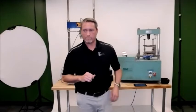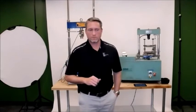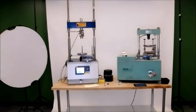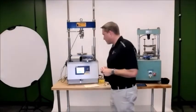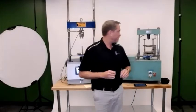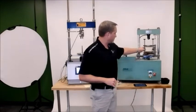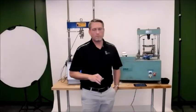Yeah, it's going to be very straightforward. You can use it in the same way. The one thing that we did have to change was some of the United frames. The older magnet style didn't work, so we had to come up with the newer style. Now the magnet allows for the range, and the height is slightly different on the United frame, but the contact is able to be made because of the adjuster that we have on the magnet now. So the LVDT can make contact. It should be no problem with the United frame.